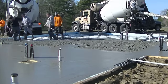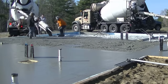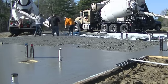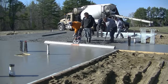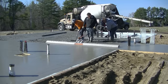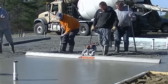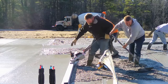That's assuming the gravel grade is really good. If the subgrade is a mess when we show up, we'll either try to rake it out ourselves or call the owner and say you've got to get that excavator back to fix it. On a job like this — 60 by 32 — we want that subgrade to be within about an inch, nowhere worse than an inch out of level. You're paying the excavator to get it level; he should have a laser. It shouldn't be that hard to get the dirt within an inch with a laser.